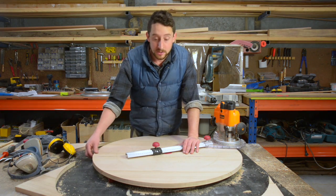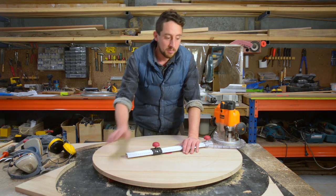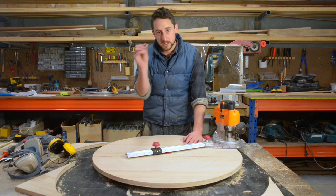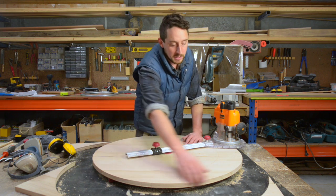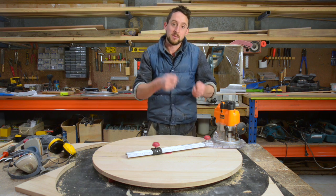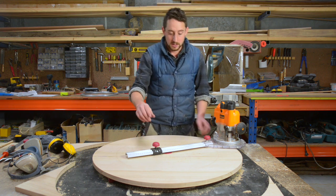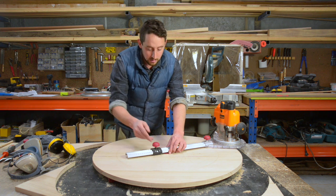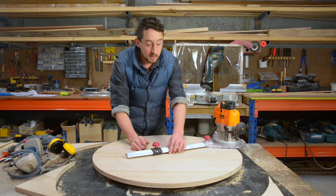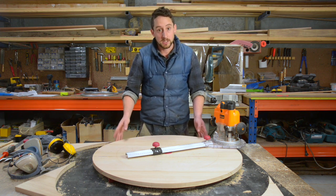The spiral bit did its job — we went through about four passes. But I'd like to do one more pass around the whole edge now that I'm not actually cutting through material, just to take half a mil off the entire thing and hopefully get that edge a little bit smoother while the bit isn't bumping along trying to cut through stock on both sides. So I'll pull this radius in by a little bit less than a mil and run around again to just shave off enough to give me a really smooth edge.